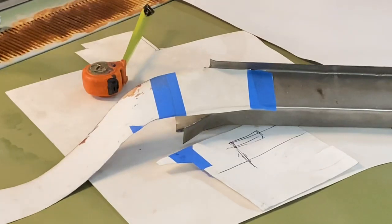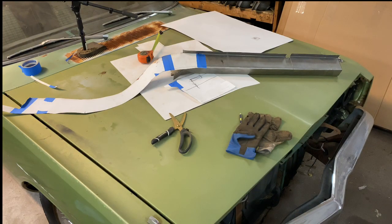This down here is pretty much where that subframe connector is going to drop into place. And I'm even thinking that I'll try to bring it back inside the frame some this way. So we'll have even some extra work. It's tempting to make the subframe connector myself out of tin. Tempting. I don't think I'm going to. I think it's just faster to buy a piece of box tube, but for one thing, it would be stronger, and I think that is a more critical piece. I could make it out of 16 gauge or 14 gauge, but I really think that just buying a piece of 1/8 wall box tube is the fastest way to do it. If you think about it, there's a lot of torque on that, and I'll explain why.